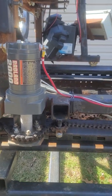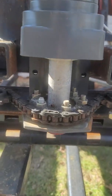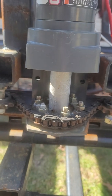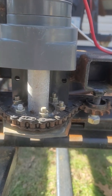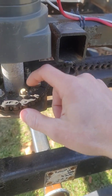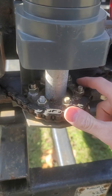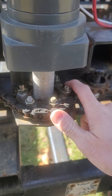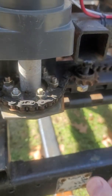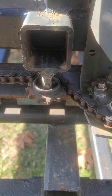It's all running off of this winch. I got this winch at Harbor Freight — it was the cheapest one I could get. What I did was I modified the spool on the winch: I took it off and machined it down on a lathe. On the winch you'll see that I bolted a sprocket on here — I think it's number 40 chain — and I bolted this down with some grade 8 bolts, I think they're 5/16ths.